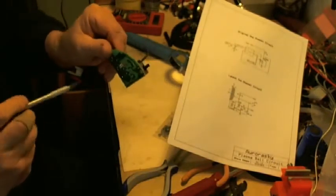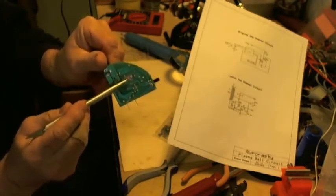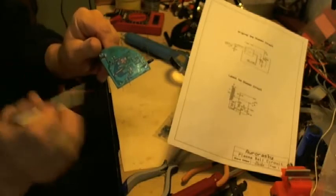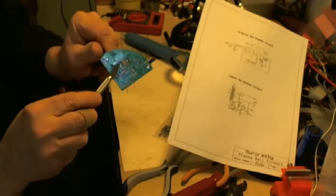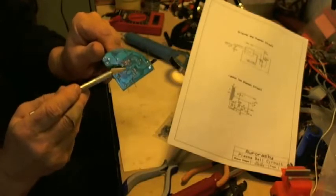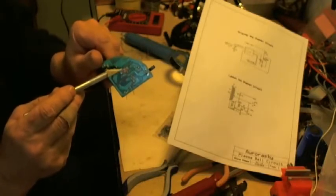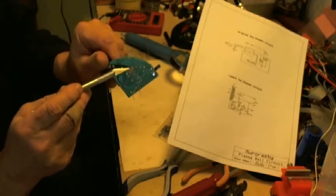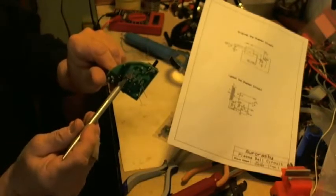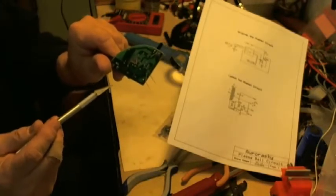One thing that I didn't mention before was this ground plane. Hopefully you can see it. This ground plane that I'm pointing to, that I made, has three holes in it. That was separated. I didn't tell you I cut a line on the other side. I actually took that extra copper foil and made two surfaces, one for ground and one for connecting the base of transistor 2 to one end of a diode and one end of a resistor. It's been isolated. There's a thin line in there. You can't see it. And I used an ohm meter to ensure that I had severed the land pattern well enough to make my own separate pads. I didn't mention that before.